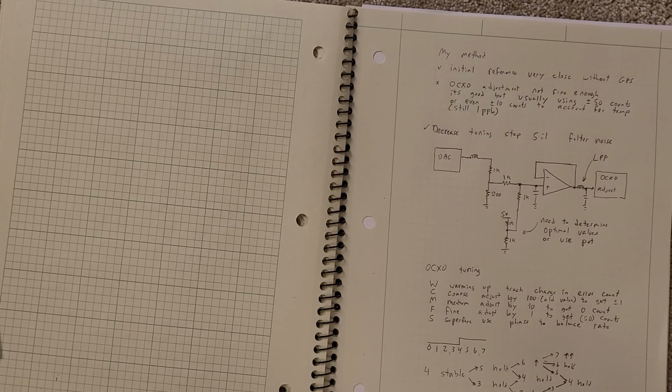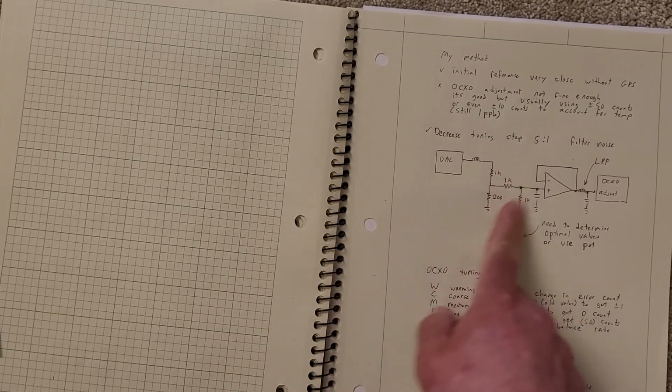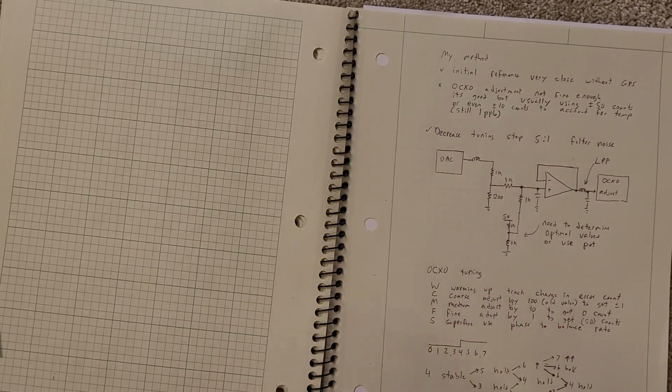Like I talked about before, I'll first probably just have it say what phase it thinks it's in and what it wants to do, so I can look at it right now and say, well, I would hit +1 twice, and see what it tells me. So that's the next step. Do the DAC reduction, redesign that top part with the extra filtering circuits, and try out the PLL on that GPS unit.